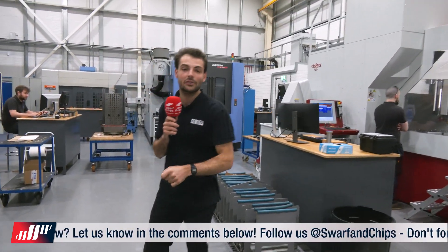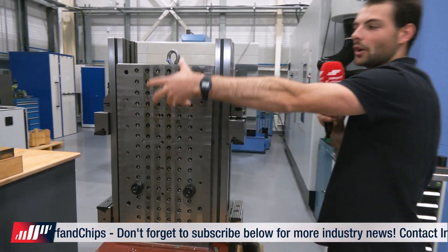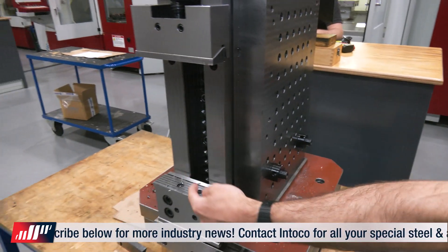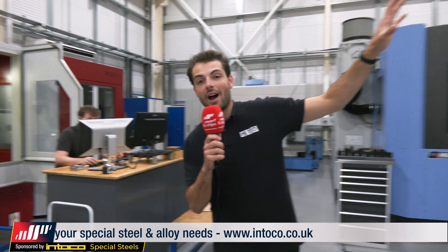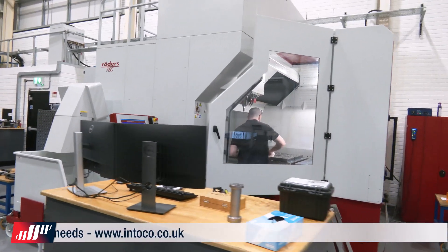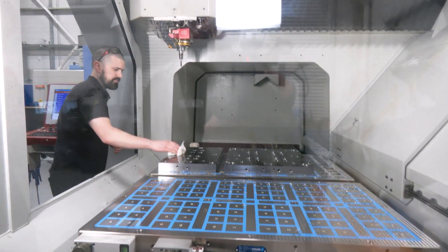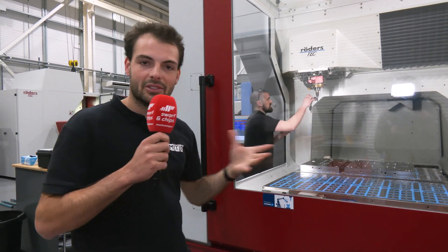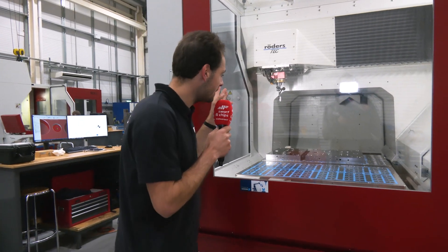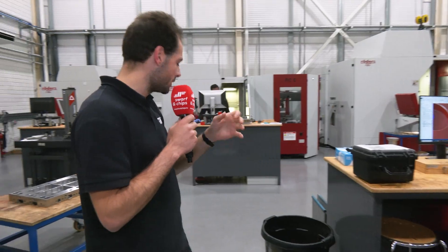All these different machines here have lots of different jobs. The Doosan behind me — a big horizontal machine tool with twin pallet — has great work holding, meaning you can set up a bolster on one side of the tombstone and a bolster base plate on the other, plus inserts, all for roughing. It's a real workhorse that can rough all those base plates and inserts before they go for finish machining on the Roda's machine. Before the bolsters are finish machined, they're roughed on the Doosan, stress relieved for a couple of days, surface ground on both sides, and then held down on a mag base. Daniel here is on a finish pass on alignment holes with tolerances of 20 to 30 microns in X and Y and on diameter — including a couple of H7 fits — and that's what the Roda's machine is so good at.